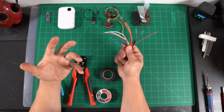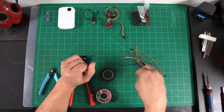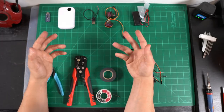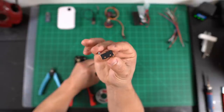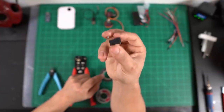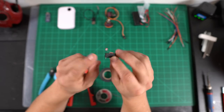Next is a set of cosplay LEDs — you can get these on AliExpress or eBay; bendable LEDs, cosplay LEDs, whatever you want to call them. We're not going to need the battery pack that comes with them. We also need a bunch of assorted wires — about 24-gauge, but you can use anything from 20 to 28. You can get wire super cheap on Amazon; I'll link a spindle roll below that has a bunch of different colors. The last thing is a trigger or button — this is a limit switch. I love using these. This is a normally open switch, which is very crucial, and there are three pins on the bottom but we're only going to use two.